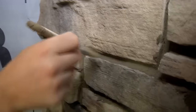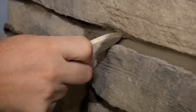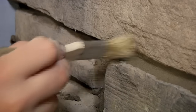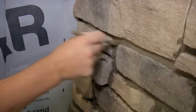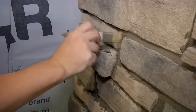Brushing is the final touch for the mortar joints. This should be done soon after striking the joints, but before the joint mortar is fully set. Clean around the edges of the stone with the wooden part of the brush, then with the brush end, brush the joint until it's smooth and clean away any loose mortar with a brush or a dry cloth. Do not use water or wet gloves, as this may smear the mortar resulting in a haze on the stone.